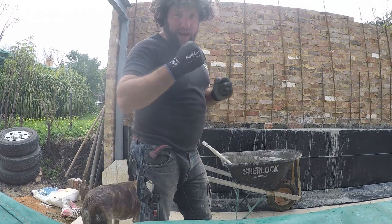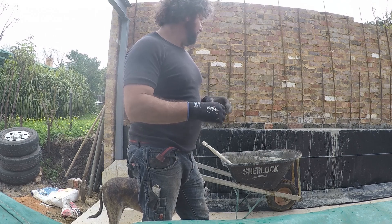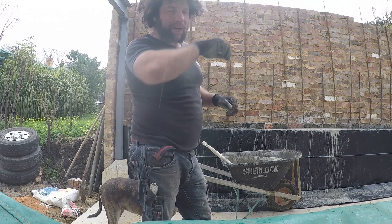It's super important to also ram it down as you go to get rid of any air bubbles, or where water's being caught underneath the brick ties and things like that.